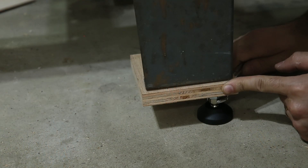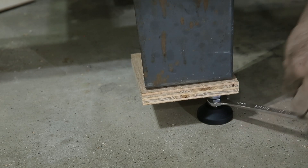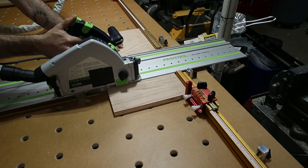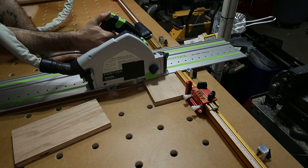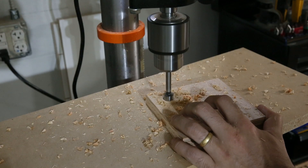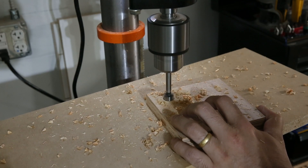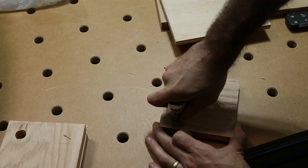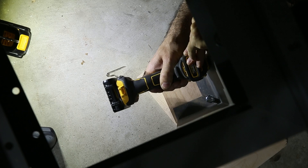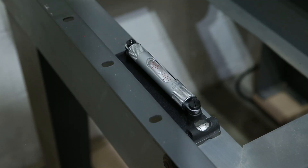My garage floor is not even remotely flat or level and I had these leftover leveling feet that came with my band saw, so I'll make some pieces to attach them to the saw base. I first cut some plywood squares on my track saw then I marked out the hole locations. I don't have the right size drill for these threaded inserts so I used the edge of a Forstner bit to kind of mangle up the edges of the holes until they would fit. After drilling some holes in the table legs and screwing on the mounts, I can finally use a wrench to raise and lower each corner of the saw stand.